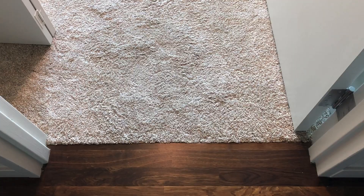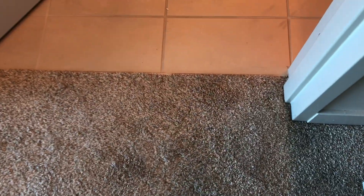This is going to cause the carpet to pull — and notice that we have a gap in that door jamb, so we'll have to section that in place. And voila! After it's stretched properly and stretched towards this tile, we've got a nice clean edge, locked tight on the tack strip, a beautiful seam, customer's very happy — saving carpets, it's what we do!